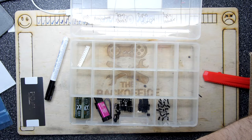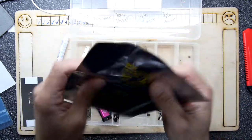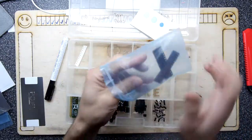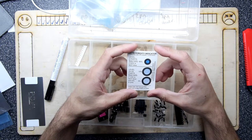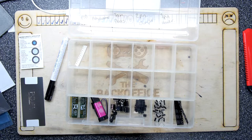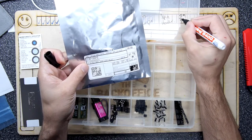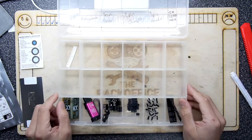Let me have a quick look to see if there's anything exciting. This sounds an awful lot like our main processors - yes indeed. They've come with their own silica gel pack. I think these bad boys deserve their own little slot here in the front. Look, it's got a humidity indicator - 'Bake part 60% is not blue'. So if you're using a reflow oven - and I'm not going to be using one today, though I will be showing you that in a future video - that's to tell you how long you need to heat them up to dry them out. I'm just going to rattle through the rest of these and we'll meet back here when I'm done.